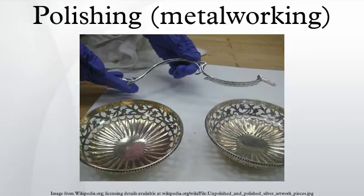To achieve a number eight finish it requires polishing and buffing compounds, polishing wheels and high-speed polishing machines or other machine tools that can be used for polishing, like an electrical drill. Lubricants like wax and kerosene may be used as lubricating and cooling media during these operations, although some polishing materials are specifically designed to be used dry.